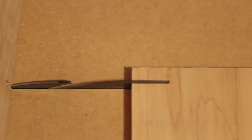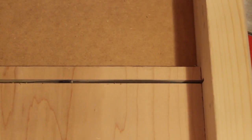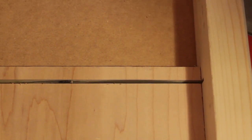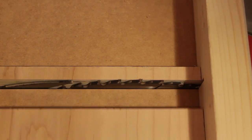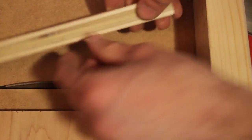Here's a test cut that I did. That outside edge is perfectly square to the edge that's referencing up against the fence, and you can see the blade is tracking perfectly parallel to it. I also got a really nice clean cut, and that's because I just cleaned my table saw blade. There's a link to that video in the description and up here in the cards.